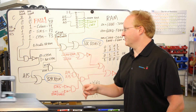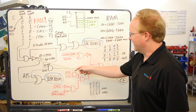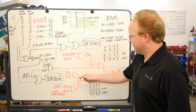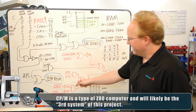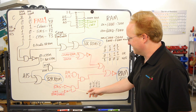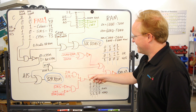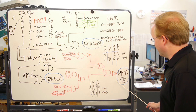Here's how that logic is going to work. On the cartridge slot, we are using pins to set B and A either to ground or high, and that will give us our states — if B is low, we're in ColecoVision; if A is low, we're a Master System; and if neither is low, we're a CPM Z80 computer. Let's start with the CPM computer. If they're both high, we get a 1 here, which immediately disables the video game BIOS ROM. We invert that 1, so a 0 means we're in CPM mode and a 1 means we're not. If we're in the first half of memory — A15 will be low — and we're in CPM mode, then we access the 32K ROM which holds the CPM system. If A15 is high and CPM equals 1, an AND gate sends a 1 to give us an enable for the RAM.